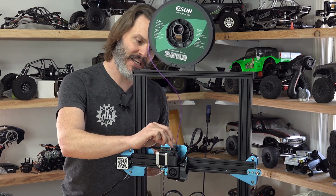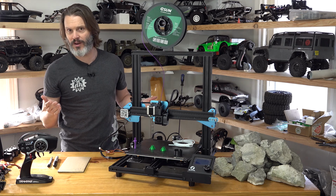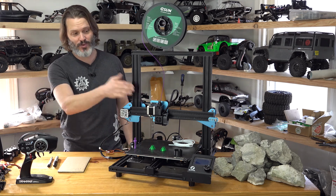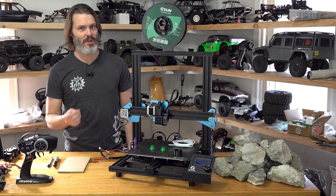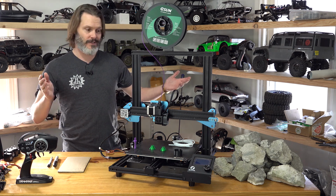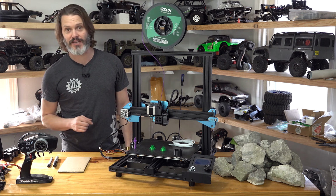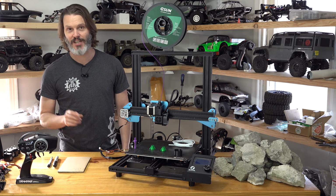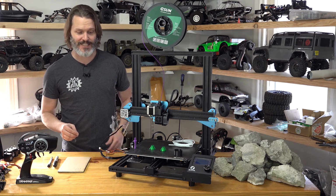It drives a gear here, and it's, I don't know, like a 3-to-1 gear ratio or something. It probably says on the spec sheet. I really don't care. I just want a direct drive. But the new ones that have been coming with this gear down actually give you a lot better resolution and work extremely well. Because the stepper motors really don't run that fast on your extruder, so you can use some gear down. You still get all of the response and speedy retraction needs that you would need on a device like this.